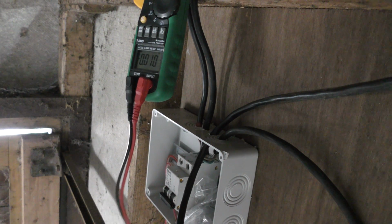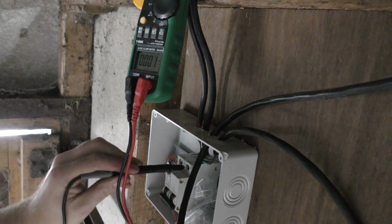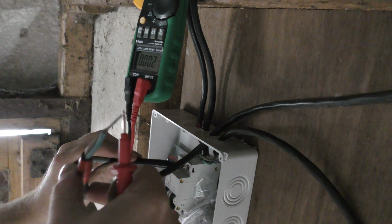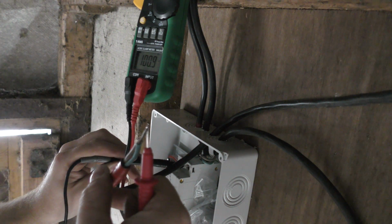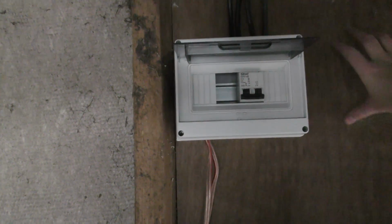Okay, the worst camera angle ever, but you can see the multimeter there, and when I plug in the minus to the old, and I have the lead here with the plus of the solar panels, get that into view, we see about 100 volts. So 100 volts DC. Good power. I can disconnect and connect everything. Okay, I am ready to connect the solar panels again.